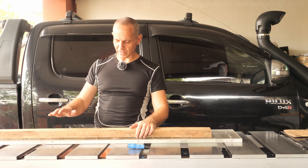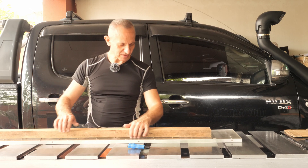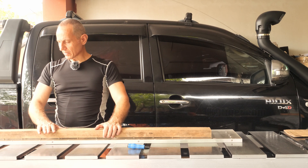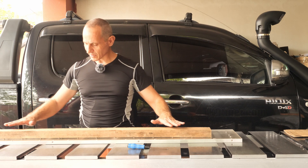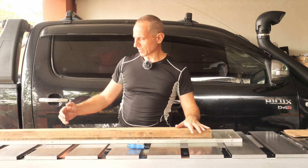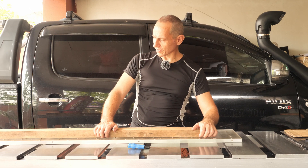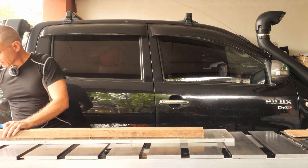It feels very solid already. Some people will say it takes forever to adjust these grab screws — actually it's not. I'm taking time to find the twisted and unsupported points and explain the process. In reality, if you use wedges it will take you a lot more time: finding the wedges, pushing them underneath, hot gluing them, cleaning them up, and so on. This is so sleek — you just adjust the grab screws, push it through the thickness planer, and see how the cup goes. When you're confident it's getting flat you can remove the sled and plane the other side. No cleanup, no finding wedges.